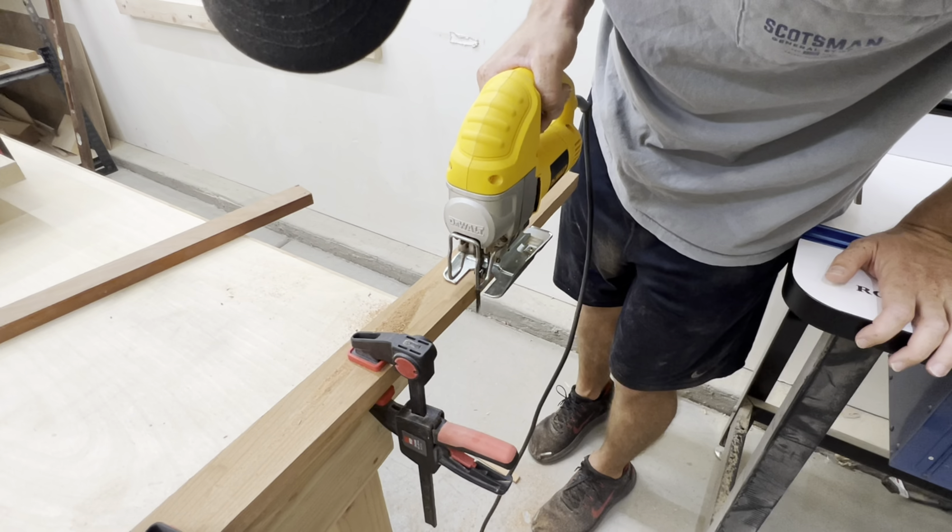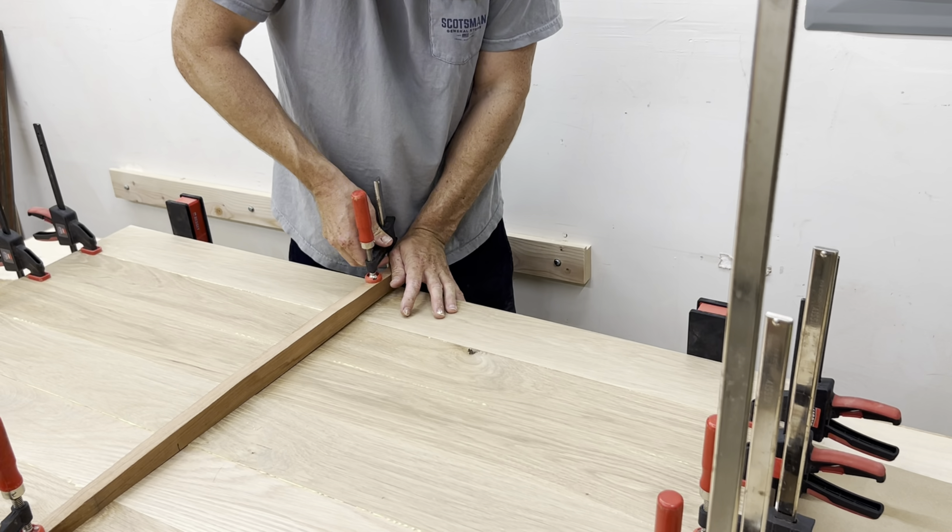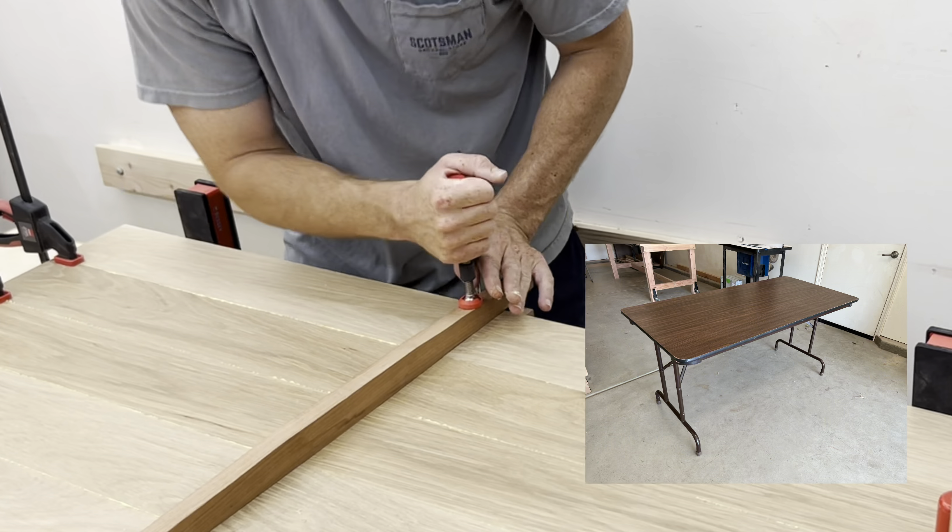When I put the white oak pieces together for the tabletop glue-up, I noticed they didn't fit together perfectly. So I made these rounded cauls to try and make this panel glue-up nice and flat — it's the curve in those cauls that pushes the panel pieces together. I'll be working at my new job from home, and my wife will use this desk as well, and I thought she could use a nicer desk than the one we currently have.